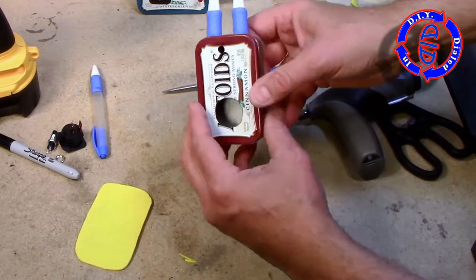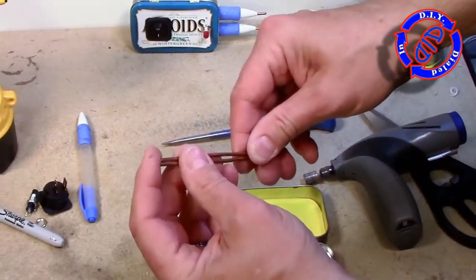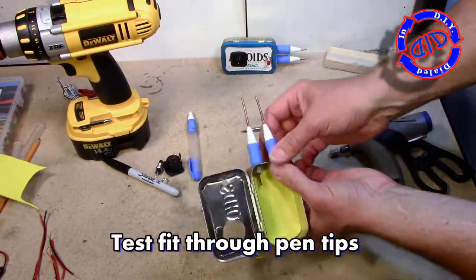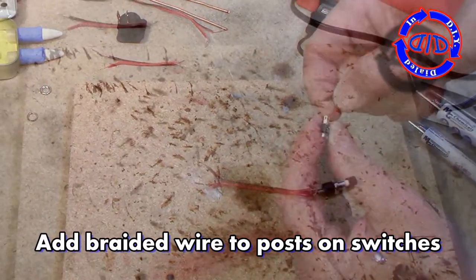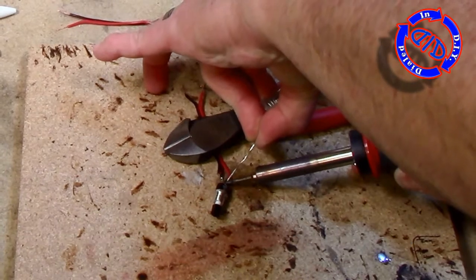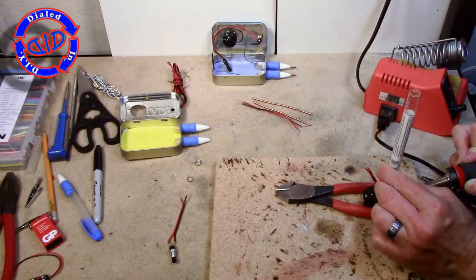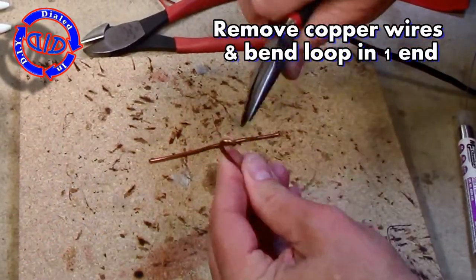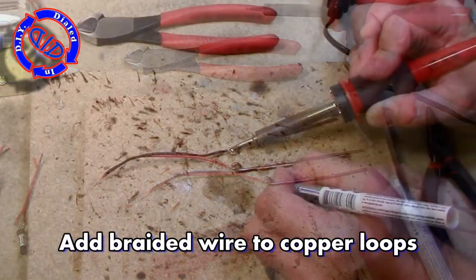Once I'm confident that everything looks good I put that foam back in and slide it right underneath the tips of the pen and continue with the build. For the actual electrodes I'm using some really thick gauge copper wire that fits perfectly inside of these pen tips — it also does not have any protective coating on the outside, which is exactly how we want it. I'm then adding some much finer gauged braided wire to the push button switch. It's actually a momentary switch — when you push it down it completes the circuit and the power goes on, but when you let go the power goes back off. Even though I twisted the wire through the holes in the posts on the switch, I did go ahead and solder it in place for extra security. I then did the same thing with the rocker switch. I then pull those copper wire electrodes back out and bend a nice tight little loop in the end of each one, add the braided wire to each and solder those in place too.